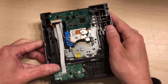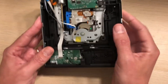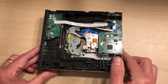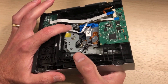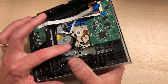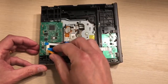Unfortunately it was still not reading. I also had to cut away a little bit of the case to fit those bigger capacitors. The next thing I did was separate this part and check the spindle — I undid the screws. The height of the screws is fairly easy to see how they go back together, because obviously you can screw this down too much and it won't read the disc properly. I lightly oiled it, spun it around — it felt okay, so it was worth doing anyway.